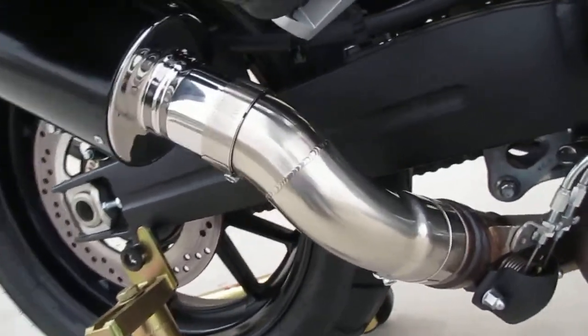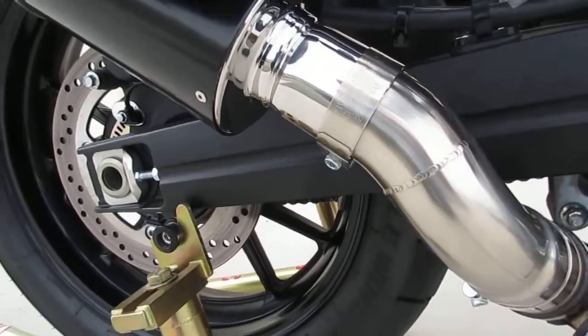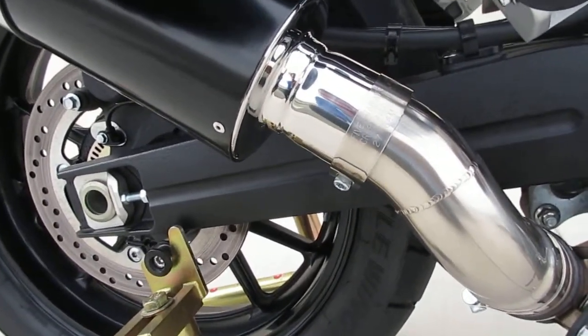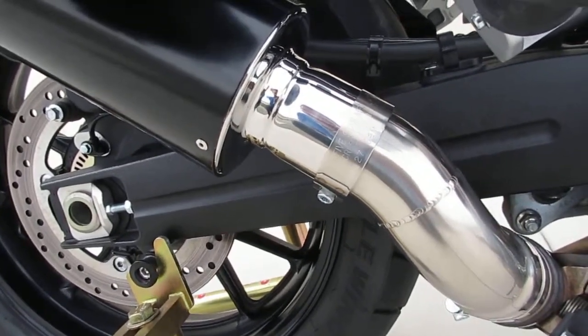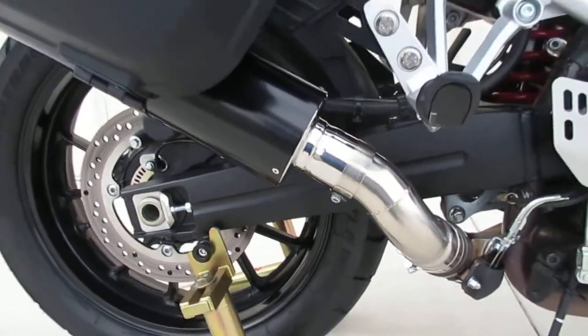These are stainless clamps that we have made with the barrel in them and the bolt, instead of ugly T-bolt hanging out the back. I don't really like springs — springs have to have a looser fit on the snout, a little more leakage, and springs can eventually break or fly off. So I don't go for springs.